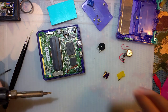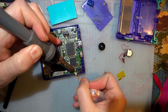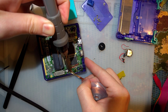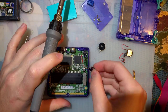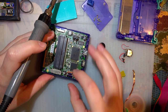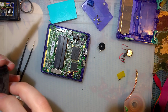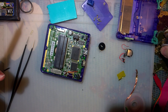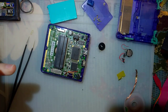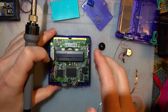I've got to go ahead and flatten out these — I'm going to use the desoldering braid, because I want to be able to get this PCB on completely flat. This will go in here just like that. All six of these contacts should line up, and it looks like they do. My solder holder is next to my computer, and if you just heard what happened — that was my computer restarting, because I bumped the power switch when I grabbed it. Whoopsie doodle. I'm sure it's fine.